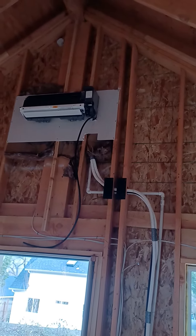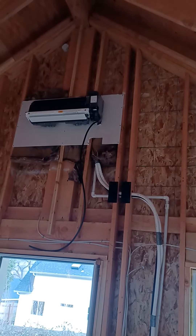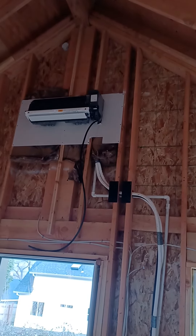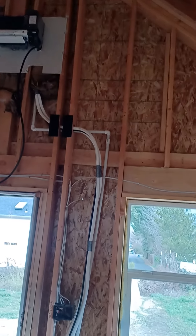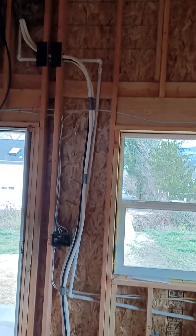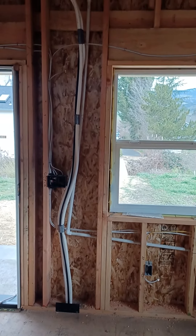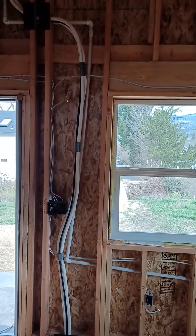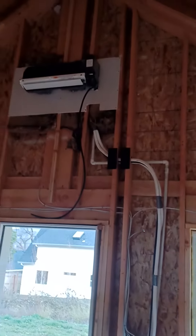It is kind of a hassle. We have to mask off the head and insulate and drywall up to this existing stuff. But that way we have a brazed line set — it's sealed in the wall. You can see we have a condensation line running out. The line set and the electrical go under the crawl space all the way back out to the rear of the house, the rear of the ADU, where the outdoor unit is mounted.